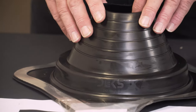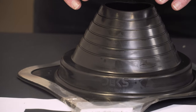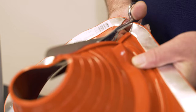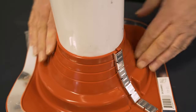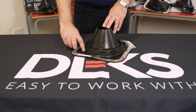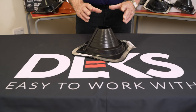Also, where you can't get the pipe over the top of the flashing, you can wrap it round. You wrap it round by cutting up the seam and then resealing the seam with the use of the provided clips, which are attached to each product. You simply make a cut, then apply some silicone and reseal it as you wrap it round the pipe. That avoids you having to take it over the top of the pipe.